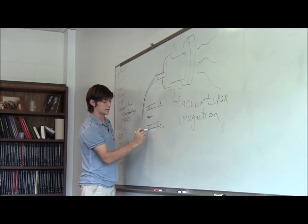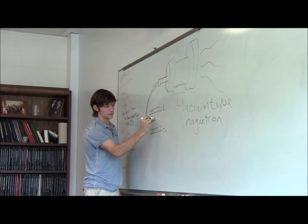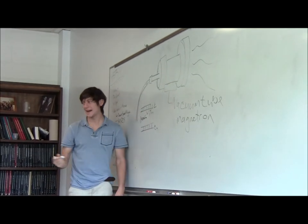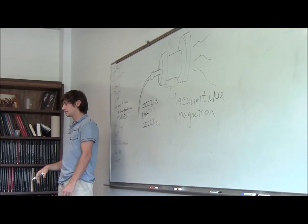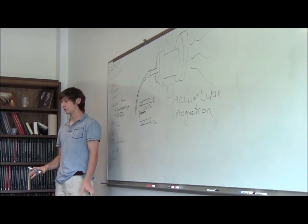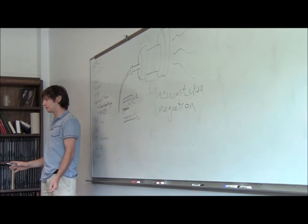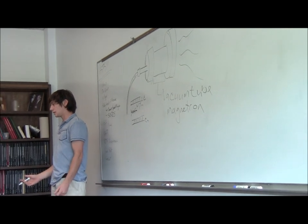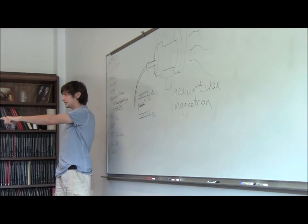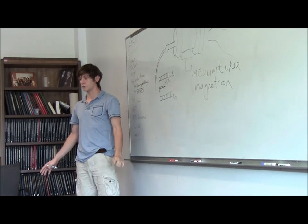It doesn't look like my vacuum. Yes, I know. And this is a tungsten and thorium alloy, typically. So if any of you know anything about thorium, you might already guess the point of this thing. Does anybody know anything good about thorium? What happens if you put a current through a thorium alloy? It's radioactive. It shoots electrons. It bleeds electrons. It just cannot get rid of enough electrons if you put a voltage across it.